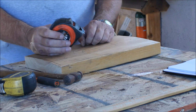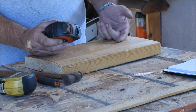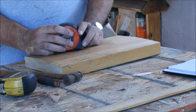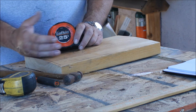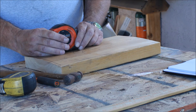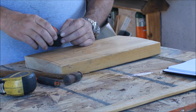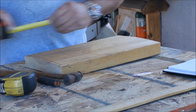Now another thing you can use these for, and I've done this, I had a wire in the bottom of a drywall wall, and I'm bringing it all the way up the wall to make an outlet and plug a TV into it on a hanging bracket, but I didn't want cords showing, so I wanted to bring it up the wall. So the cord's way down at the bottom, so I cut a hole in the top where the box was going to go, and right here you still got that little cutout like I showed you.